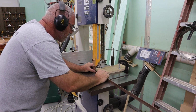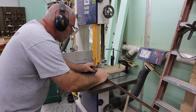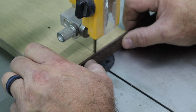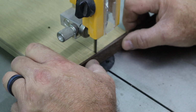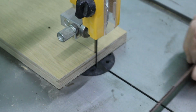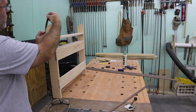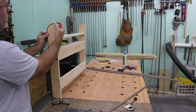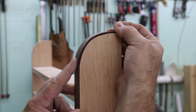This veneer is slightly over 1/8 inch in thickness, and I will cut slots into it about 3/4 of the way through, with about a kerf width and thickness between each cut. As you can see here, it works perfectly, but we need to strengthen up those ribs and most definitely want to be careful when sanding.